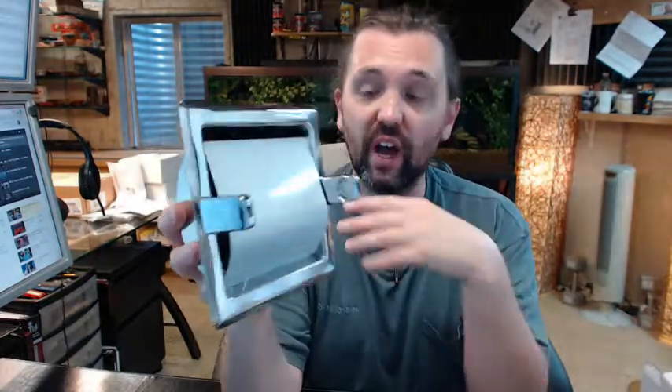Your dash 55 could be a very important aspect. If you have got a drywall, a gyp wall, a hollow situation where you don't have anything to screw to, you are going to need the dash 55 because that will give you a big clamp that you slip into the wall, and then the two screws from the unit grab into the clamp. As you tighten it, the clamp comes this way, the unit comes this way, and it sandwiches onto the wall — that is how that installation would go.